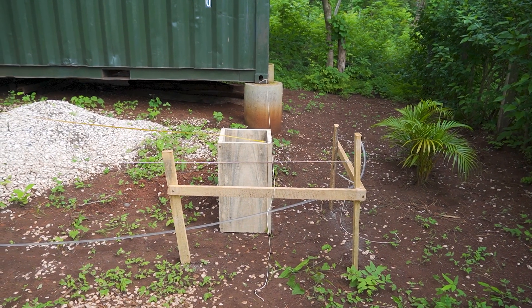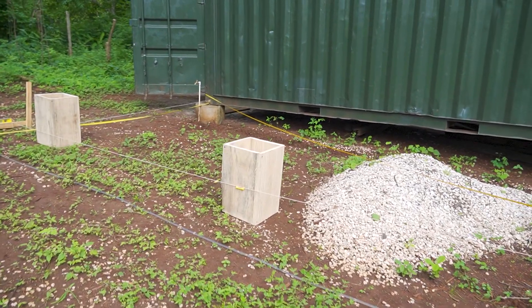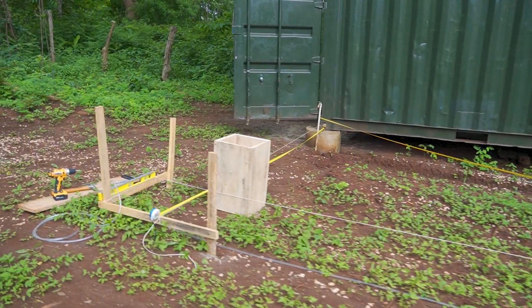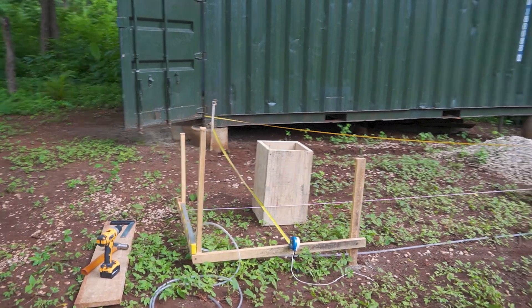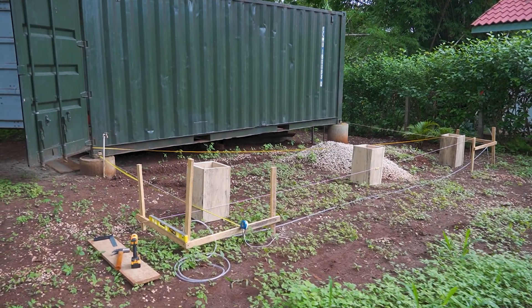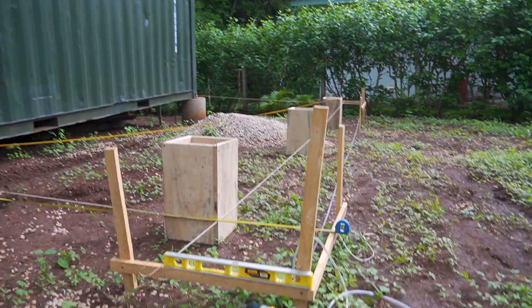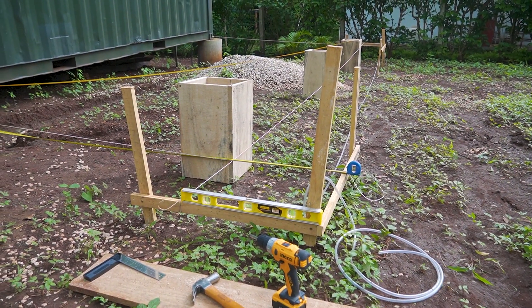This time I left some more space so I can dig the holes. The wood boxes will be 40 centimeters under the ground, and the last 15 centimeters will stick out from the ground, where the posts will sit on the concrete. It was pretty complicated to measure everything correctly, but now it looks pretty good, so now I just have to dig the holes.